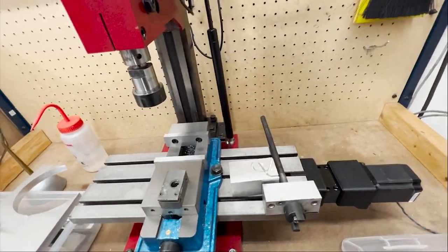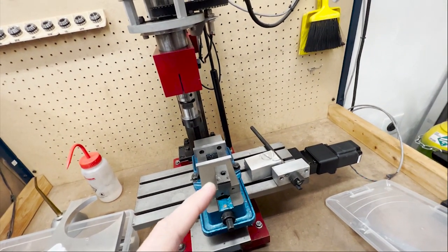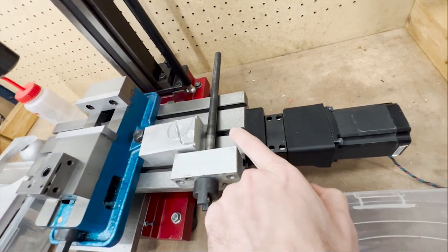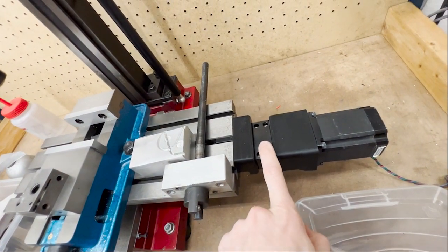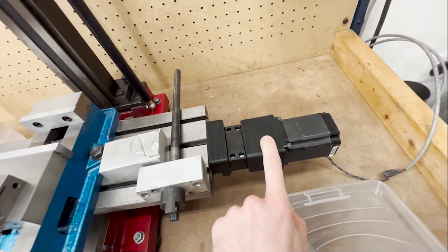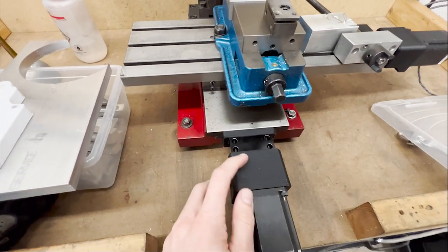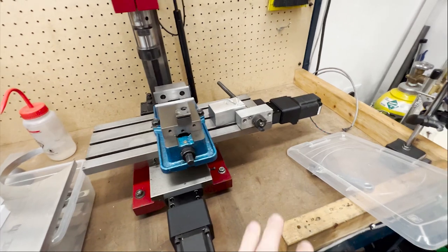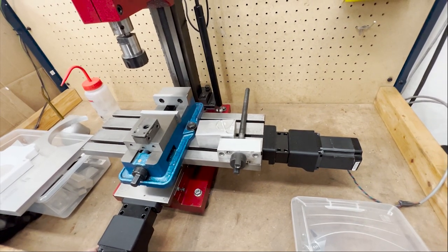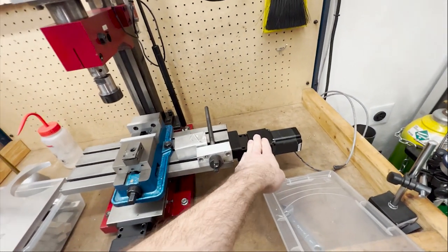So I actually upgraded to some very inexpensive ball screws — I'll link what I bought in the description below. I also 3D printed these adapters to go from the mini mill to the kit that came with the ball screw — basically the bearing support — and then a little motor mount. I printed those out of ABS on my little 3D printer. It seems to be moving all right; I've got it moving for quite a while, but I haven't cut anything serious. So this will be the first real part I wind up machining on here with these new upgraded X and Y-axis ball screws.